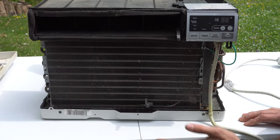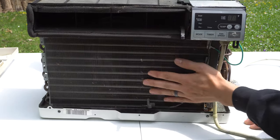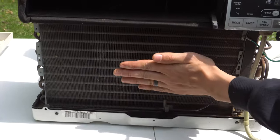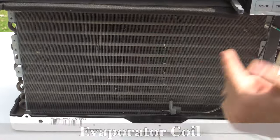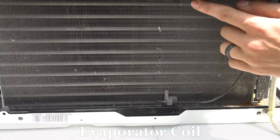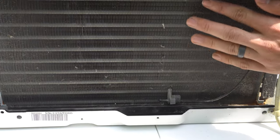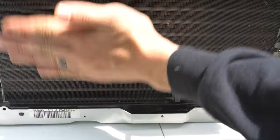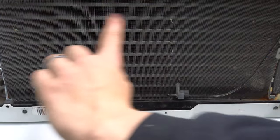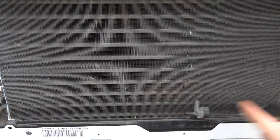Let's start with the big components. The one in the front — the one that's inside the house — is called the evaporator. The one in the back is called the condenser. All this is is a bunch of aluminum fins, just thin sheets of aluminum going up and down. Inside there are copper pipes that loop back and forth, and that's where the refrigerant or Freon is going to flow. So we've got one of these coils in the front and one in the back.